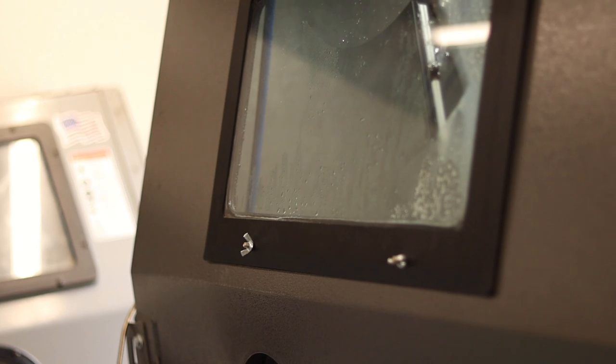This particular one is made by Raptor Blaster. And what it does is actually takes parts and polishes them. So aluminum parts come out looking really good once you figure out your blast PSIs, your blast media, all that sort of stuff. There's actually a ton of technique and pressures and specs involved to make stuff look like this. It's not too hard, but it does take some practice. And needless to say, it's a lifetime tool. I don't see it rotting out anytime soon.